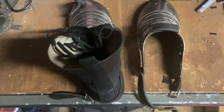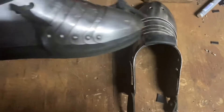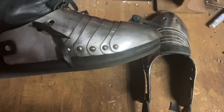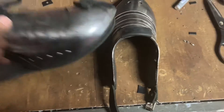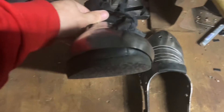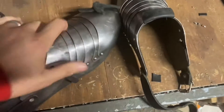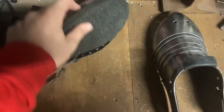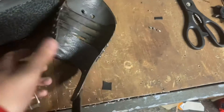In this episode of 'What's on the Bench' we've got a little bit of a sabaton remedial. These sabatons don't actually sit on the outside of the foot far enough down. I think that's a combination of the plates being slightly skewed in terms of width across the foot and the shoe. The remedial we're going to do is take the second rivet out of either side and fix on the inside a tight strap.